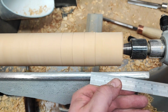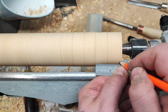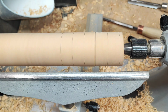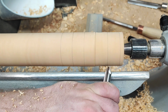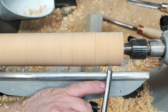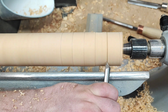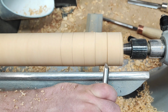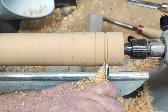But I did lose a mark here, so the proper way to start is to close the gouge. So this is now at 3 o'clock facing, the 9 o'clock facing flute. Now you can start. Okay, and I will start a little bit more in. Open the gouge once you're in the wood